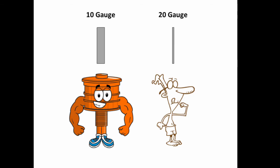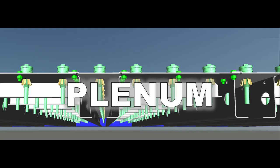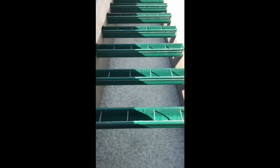Maximus solves all these problems by effectively creating a 10-gauge plate underdrain with free flow orifices that in turn create an open plenum. And with nozzles on 6-inch centers each way, excellent flow distribution is assured.